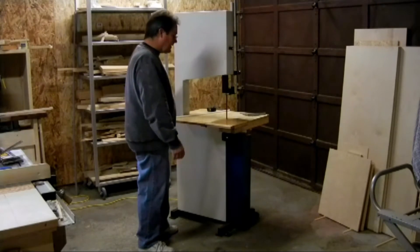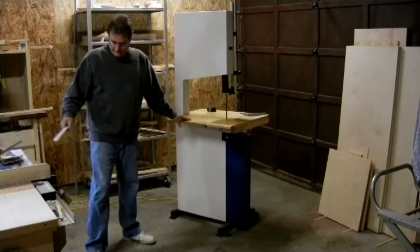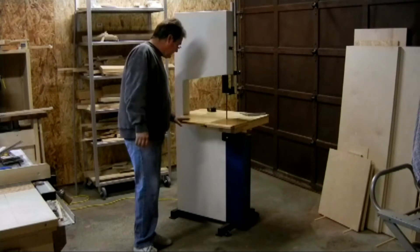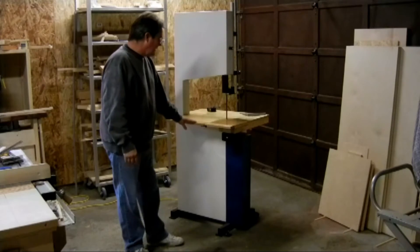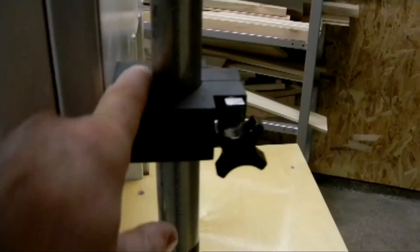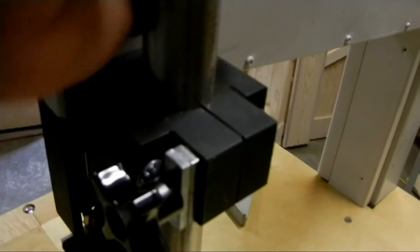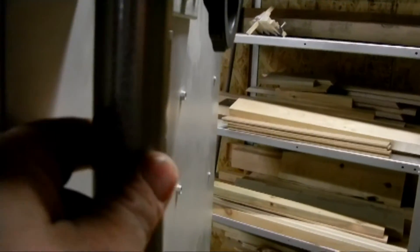Whatever I want to do — maybe I want to rip some thin strips, and this would be the best thing for it. The table itself doesn't tilt. I thought that if I want anything to be cut at an angle, I can easily make a jig to angle it and make that cut. Here's the upper blade guide — you can see the thrust bearing, it's adjustable back and forth. Here's the upper mechanism for the blade guide. It has two clamps — these are made out of solid maple. This one is split to allow it to tighten around this one-and-a-quarter-inch pipe and has a wing nut. The upper one is solid and it just guides the part up and down.